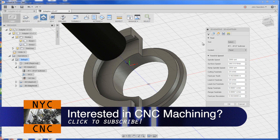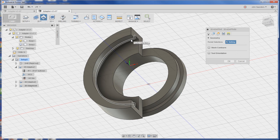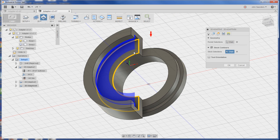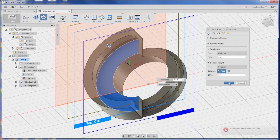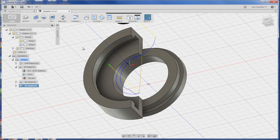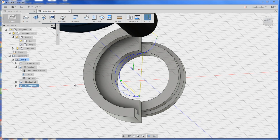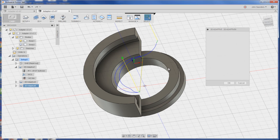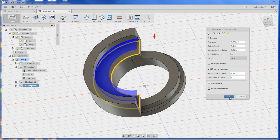2D adaptive clearing, same tool. The geometry is going to follow this line, and then for stock contours let's just choose this face here. Same thing to pick the right bottom geometry, which will be that face. It's recognized that we already have cleared some of that interior — it's probably because we chose the stock of this. Let's leave a few thou for cleanup and we're good.